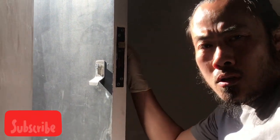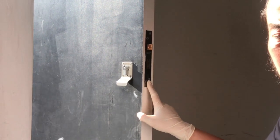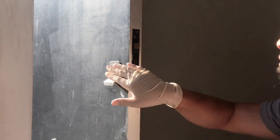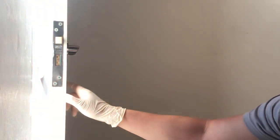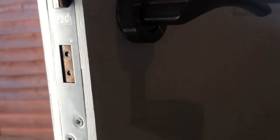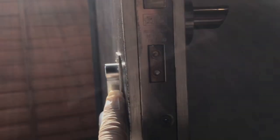The first thing you've got to do is take this front cover off. This type of lock uses what's called a half cylinder — you've got your euro profile on one side and nothing on the other side. We're going to take this plate off, and there is a holding screw that holds the euro cylinder in the case.